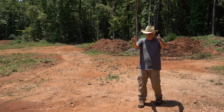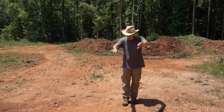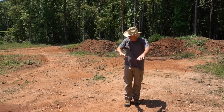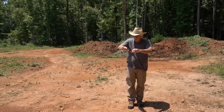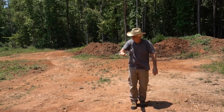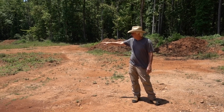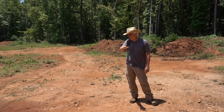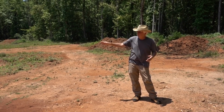He's going to dig mainly where we want the lowest point. Dig it down a good ways, and if we start getting a little cliff on each side, then he's going to get in that cliff and kind of drag and start making a slope in that direction and making a slope in that direction. Go down deeper and just keep working it out, down, out, down, until we are satisfied with what's happening over here, and we can take that dirt away from the edge of the crawl space hole that's there now, because that dirt has been holding back any rainwater coming down this hill. Once we get this little trough, gutter, whatever you want to call it, we won't need that dirt anymore.